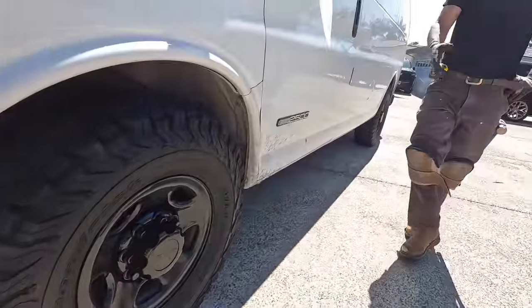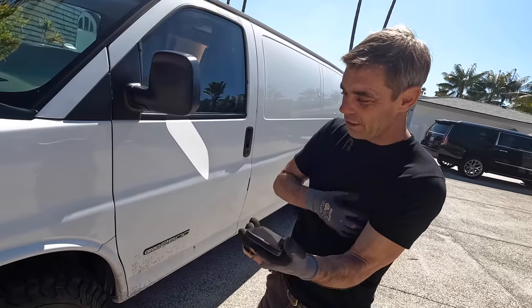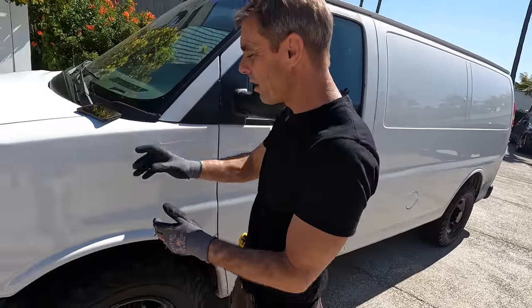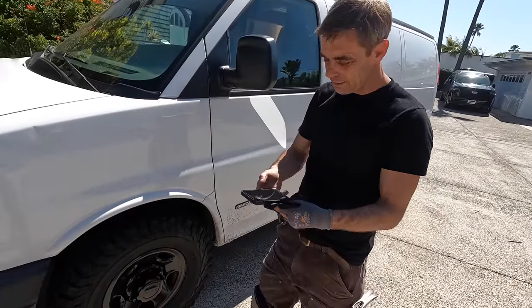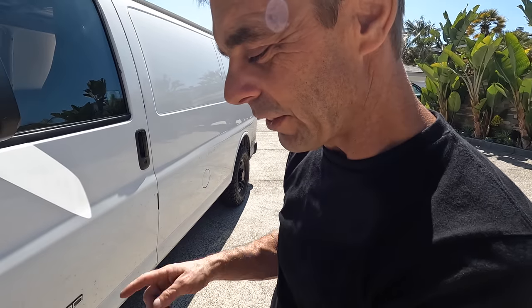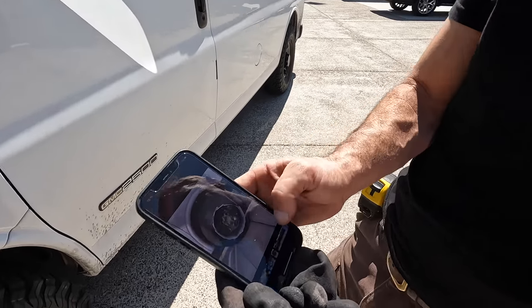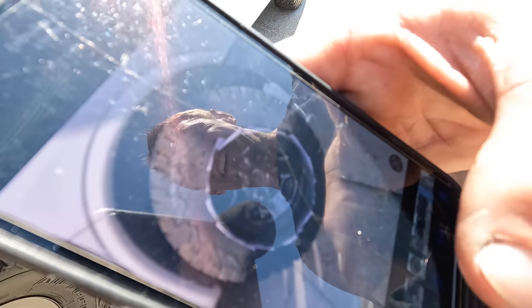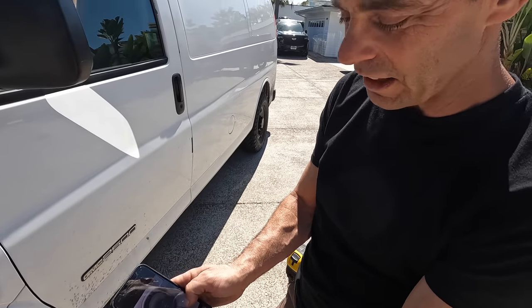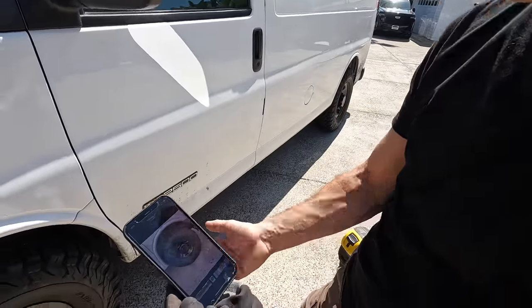Well, now hang on, dog. I mean, you got like a couple of tips here. This was like the gold standard. I've had multiple compliments on it, and everybody thinks that I spent money on the wheels. I didn't. I just followed Rhino's little moves here. You mask it with these index cards. I took the hubcaps off, right? And then you use this self-etching Rust-Oleum spray paint primer, and then first coat, second coat, dude, looking good. And then I did the hub caps, I guess you call them. Did that later on, let it cure up, and then boom, baby.